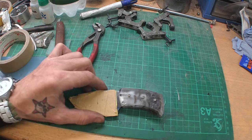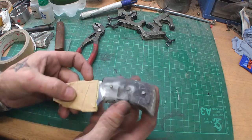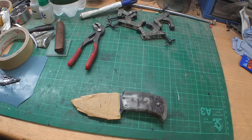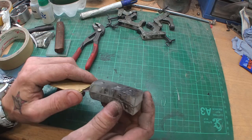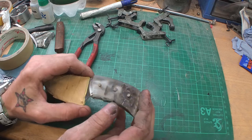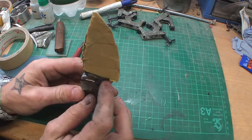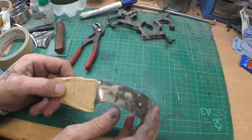But for a cheap, easy knife like this, there is a machine grind on it, or even you can make a hand grind by 400, you can stop. So, next thing, as I said, we're gonna do is grind the handle completely. I'm gonna grind it on a machine to about 240 grit, and after machine grinding, we're gonna go hand polishing with a 400, 600, 800, 1000 grit, same as in the front here, so I want it completely clear, and then we go on a buffing wheel.